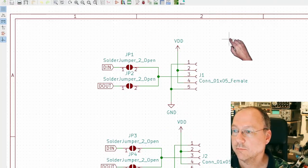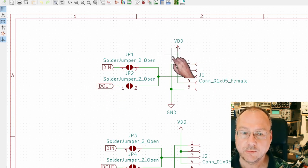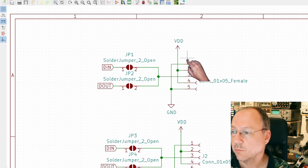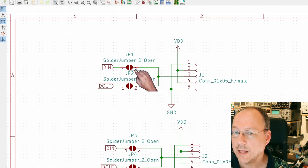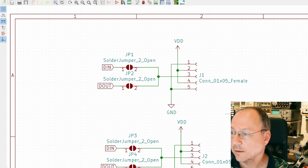So each of these repeated blocks here is one of the edges of the circuit board with its castellated 5 connections here. The outer 2 are ground, then comes 2 times VDD, and the middle pin is our data pin. And depending on the setting of these 2 solder jumpers, either the D-in pin or the D-out pin is connected to the middle pin of this jumper. And